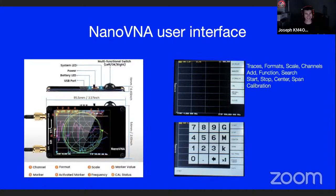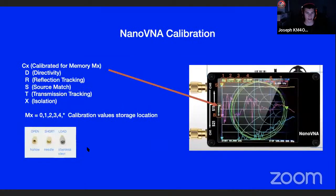Yeah, I need to get me the set of calibration points then, especially when I try and use this on the higher frequencies where it's more important. The readings actually correspond pretty well to the MFJ analyzer that we have on the 2 meter band and below. The readings seem to be almost identical, so at least it's working pretty well for that. But since the MFJ we have doesn't go up to UHF, this is kind of all I've had. Since I haven't really calibrated it, I need to do that.